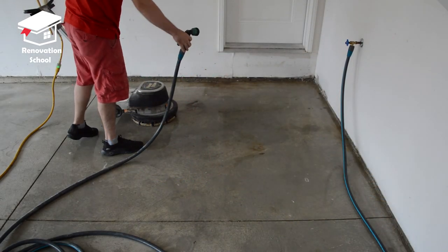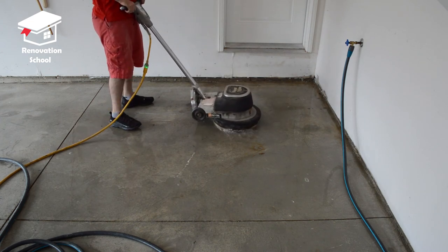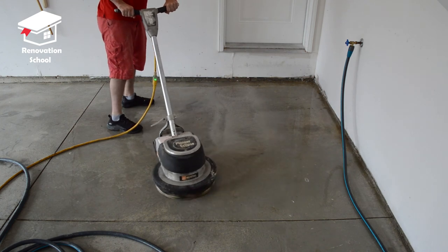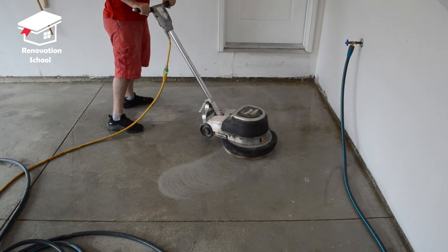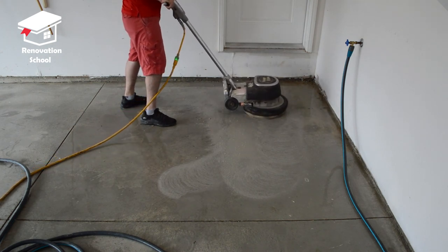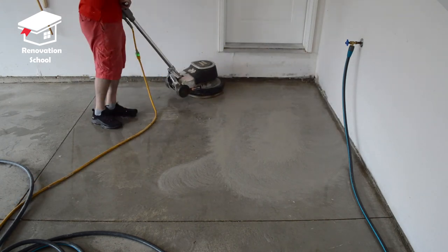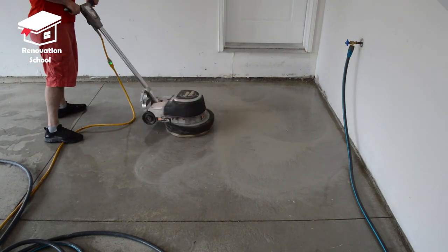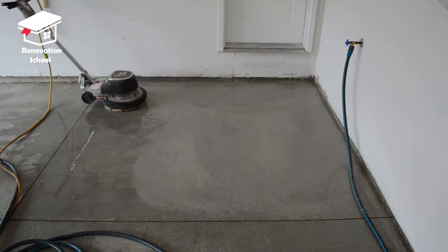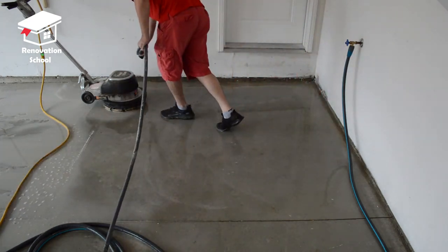It's a good idea to add some water to the surface of the concrete before grinding. It's not an easy machine to operate, especially since I used the wrong type of grinding disc — I should have gone with the bare-concrete type since I don't have any paint or sealer on my surface. The idea is to etch the surface, grind down the whole floor so there's no loose dirt sitting on top, and remove as many stains as possible. Go in every different direction — right and left, up and down.